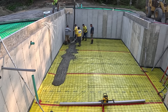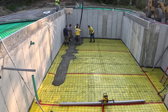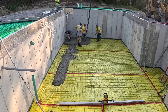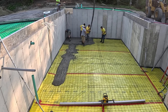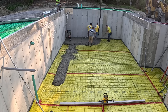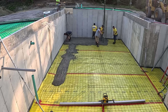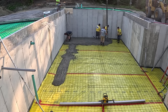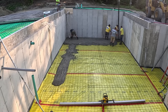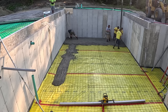Today the spec on the concrete was 3500 PSI with fiber mesh, water reducer, half air. We used the Stego Industries 15 mil vapor barrier — shout out to Stego for that. We had ISO strip up against the wall. This was on a three-quarter inch crush rock sub base that was put in in layers and compacted really hard. And then there's wire mesh — you can see it right now. I'm pulling up the wire mesh just for you guys that are the wire police out there. That was the spec on this job: four inches thick, basic simple concrete basement floor.